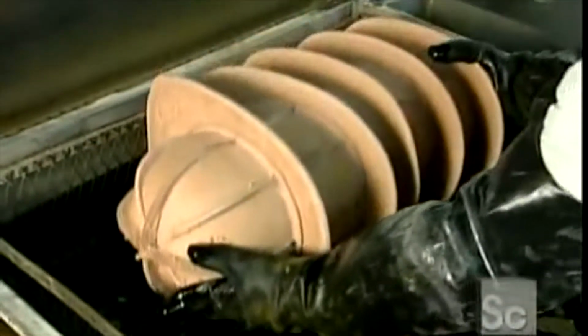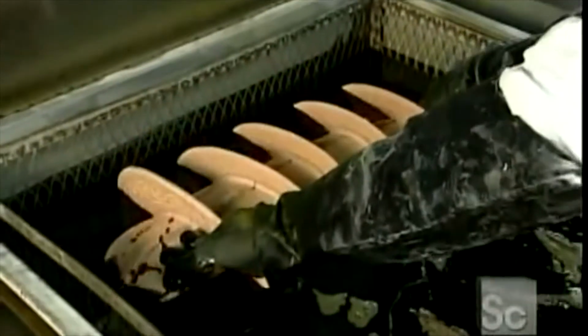To seal the leather, they dip the hats in a vat of hot rosin, a type of tree sap. After 55 minutes, they remove them and let them dry at room temperature for 8 weeks. This slow drying process makes the leather about as hard as wood. Drying it mechanically would make it brittle.